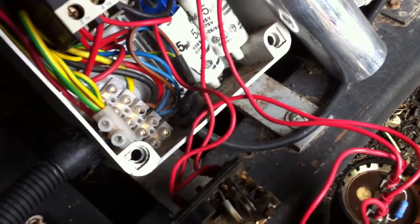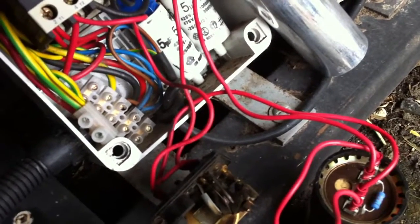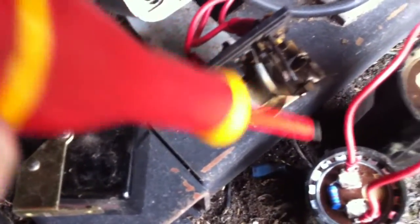Which does look to be a capacitor fault. But as they check out OK, I want my attention to turn to the little relay that switches the start and run capacitors out of circuit.